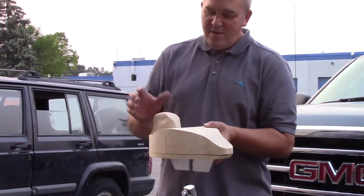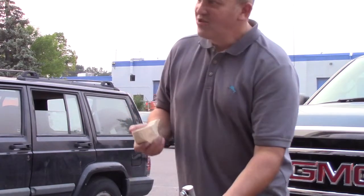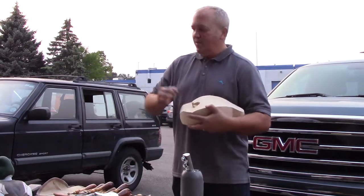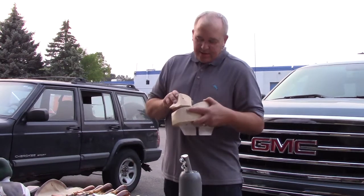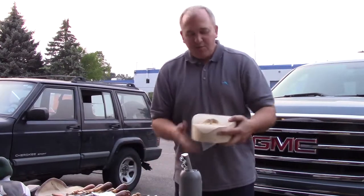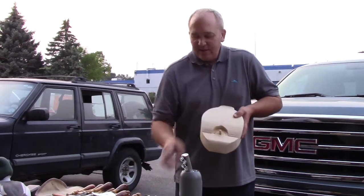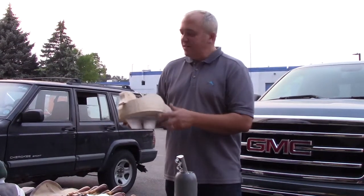Then if you want it turned, now to get that head to drop down to the shelf, I've got a drill press, or a regular drill would work, with a Forstner bit, and I'd set that drill press with the Forstner bit so it can't go down any farther than the shelf. So I turned it a little bit. So before I drill anything, it's sitting up like this. And then I just trace it like this here. And then I go to the drill press and just slowly take that out. You can see where I have a bunch of holes that I drilled. That'll kind of bore that out down to the shelf so you have a nice flat shelf. And then put your dowel in there and it fits right in there.